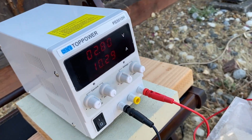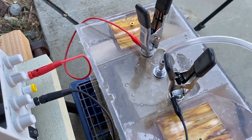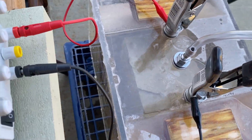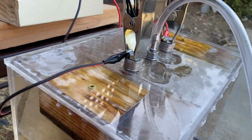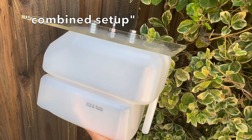Although we're pulling 10 amps, which is really good, the bubbles that are coming up are not flowing through this tube into the bubbler cup. Instead there's leaking out the side. I still need to add some kind of collection device under here to direct the bubbles into the opening. I need to eliminate as many places as possible for where the gas can go.